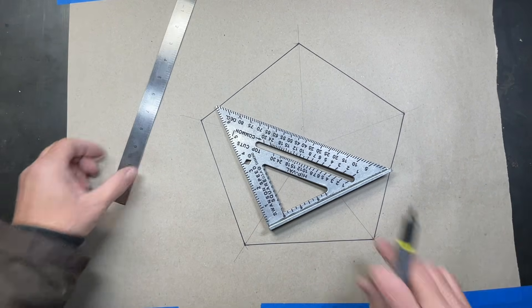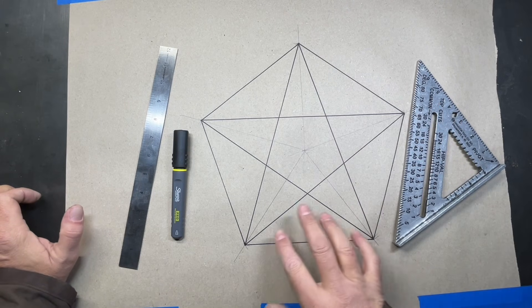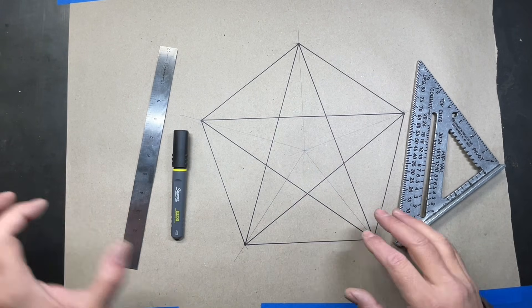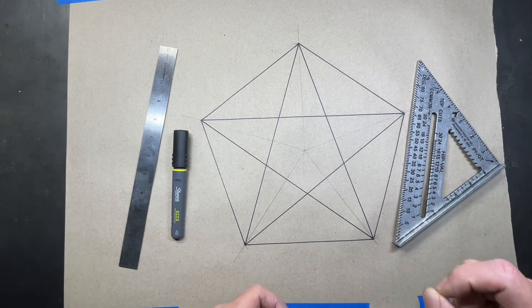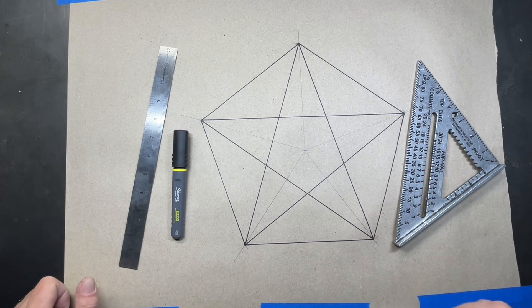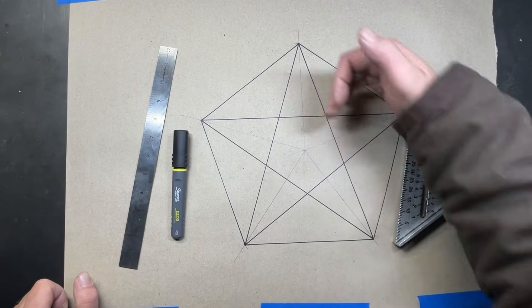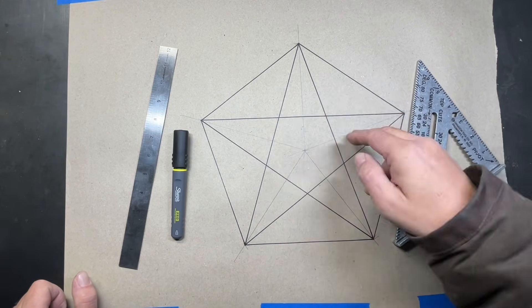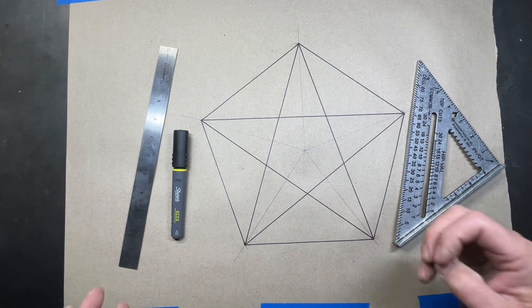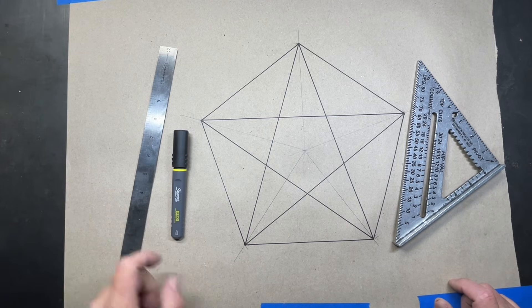And there we have it — we just laid out a pretty good pentagon with a speed square and a straight edge. I went ahead and laid out both the pentagon and the star. This is not a regular pentagon exactly because we are off about a half degree, working around the camera. Normally I can get these within about a quarter of a degree or less of error. You can alleviate some of that error by drawing the first two in one direction and the second two in the other direction — that way you stay a little bit closer and don't accumulate error going around. Anyway, this is just a cool little trick you can do with a speed square, a marker or pencil, and a straight edge. I hope you can get some use out of it, and I'll see you in the next one.